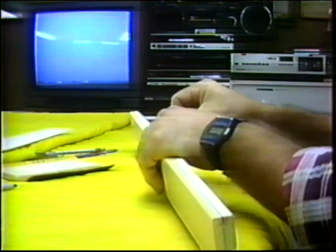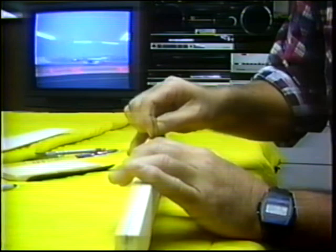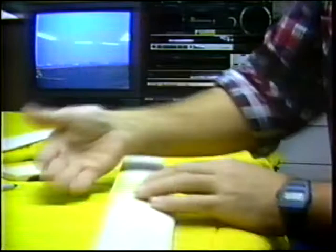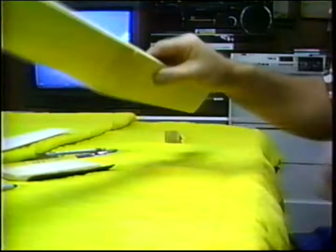I'm going to do it just cleaning up the hole here, the little slot. Put some folded sandpaper and get a nice radius where that bushing is going to rest in the trailing edge. Again, you don't want to make this slot any longer or any wider than it has to be, just to get that. In other words, it doesn't have to go any further back. And when the controls are in full deflection, when this seals up, this slot doesn't have to go any further forward. That's an important point. Keep the tail as rigid as possible and as light as possible.